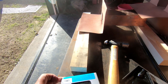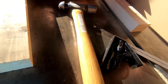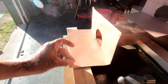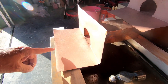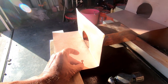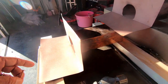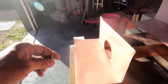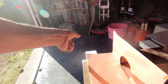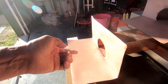What I plan to do is first cut the hole in the roof — the EPDM — and then slide this thing in. I want to pre-drill maybe five nail holes top and bottom and possibly leave one here and here. I want this thing flat to the roof, and then we have rubber covering here, here, and then going across here and here. So that's a lot of things added right where the water needs to get out.